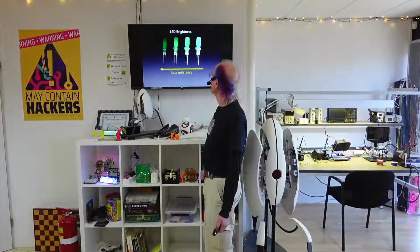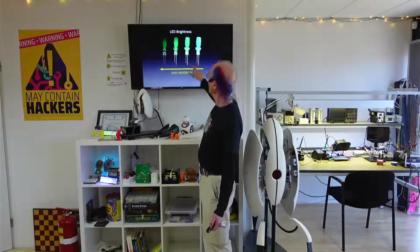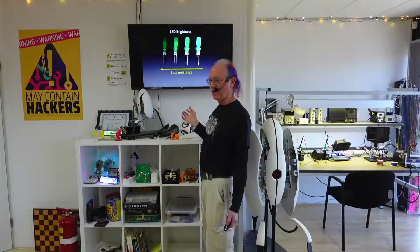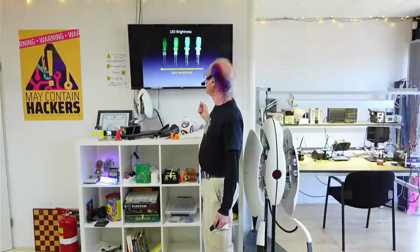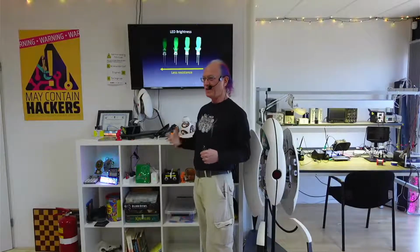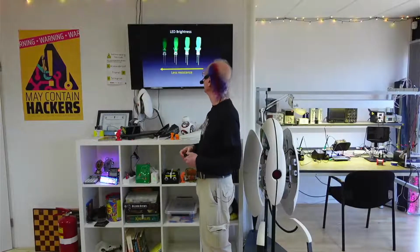All right? So this we do by this circuit, changing the value of the resistor, we can get as bright or dim as we want. That's one way to control the amount of light out of an LED. We're going to do it differently today, which I'll show you, because we don't want to make these get brighter and dimmer. We don't want to be constantly putting resistors in and out. We want it to be controlled by a computer. And resistance normally isn't controlled by a computer chip, microcontroller. But we can do this trick called pulse width modulation, which I'll show you in a bit.